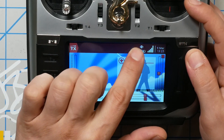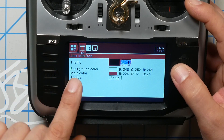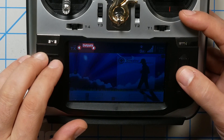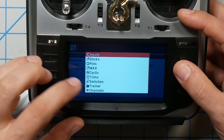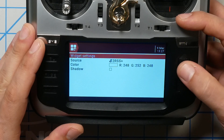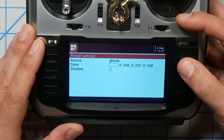The first thing I like to do is put some widgets in the top bar. I'm going to hold down the telemetry key, page to 'User Interface', and scroll down to 'Top Bar Setup'. I can put one, two, three, four values here. I want to select the value widget, which can hold a telemetry value conveniently right at the top of the screen. I'll highlight a position, click the wheel, roll to 'Value', click again, and choose the source — long pressing on source gives me a list. I'm going to look for telemetry and select RxBT for my battery voltage.